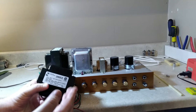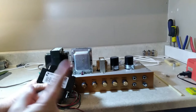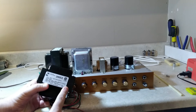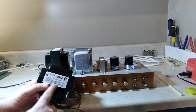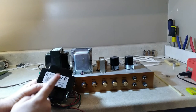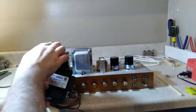The question is: why not just buy a Mojotone transformer if it's a drop-in replacement? Number one, there's a shortage of transformers right now and many manufacturers aren't selling spares — this Hammond was in stock at a major supplier. Number two, the Mojotone transformer seems a little hot: it's a 700-volt center-tapped secondary, while this Hammond is 660V and this original is 600V center-tapped, making it a pretty good compromise.